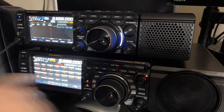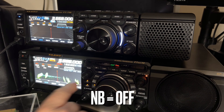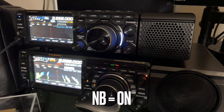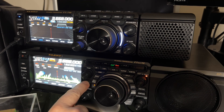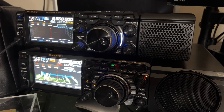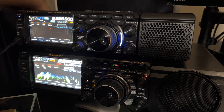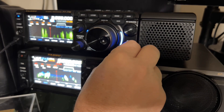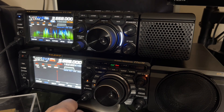So that seems to be about as good as it gets. Here we go — without noise blanker, and with. Let me turn off digital noise reduction so now they're equal. Off. On. Yeah, it's handling it pretty well. That is more gnarly than just power line noise. Let me switch over to the 710 — without, then with. It looks like the noise blanker is better in the FTDX-10. The noise blanker in this radio uses the NXP semiconductor's chip.